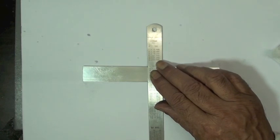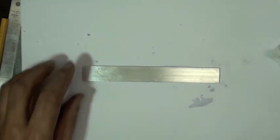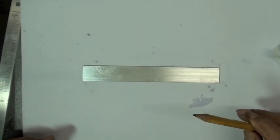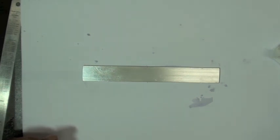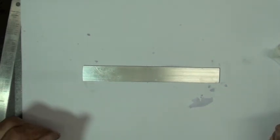on the surface. It depends on the material that you're bonding the gauge to, but VJ, what would you recommend for steel, if you were working on a harder material such as steel? Well, if it's a hard material which cannot be marked with a pencil, then we can use a ballpoint pen. Excellent. Which has a nice round ball in the front. That will not create a scribed mark, but it will burnish the surface and create the same effect, so that the mark is very visible under proper light conditions. Right. Allows us to align the strain gauge properly. Excellent advice.